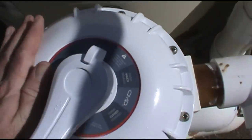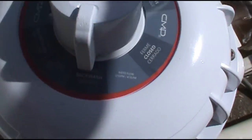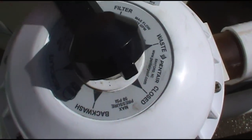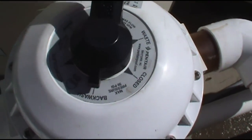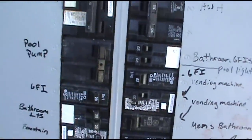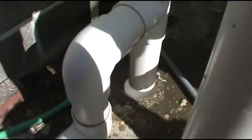All right, now that the pump is off, go clockwise to backwash — do it to both. The sand filter: I've done DE and I've done saltwater pools. I like sand the most, a little more maintenance-friendly. You can see how milky it is. Whatever that clears up, I'll be ready to go.